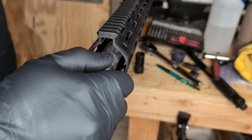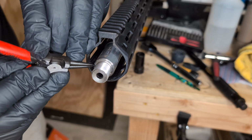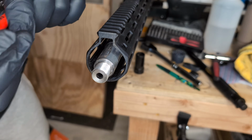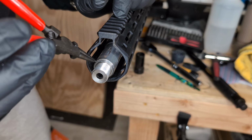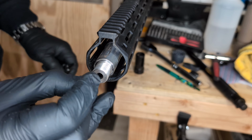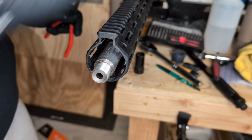Unlike the URX4, which takes a ton of torque, this does not. You're looking in the ballpark of 18 to 22 foot-pounds as optimal. So you want to get to about the 11:30. 18 should get you about dead center at the 12 o'clock, but it's fine if it's a little shifted left or right. And it really depends on you, right?